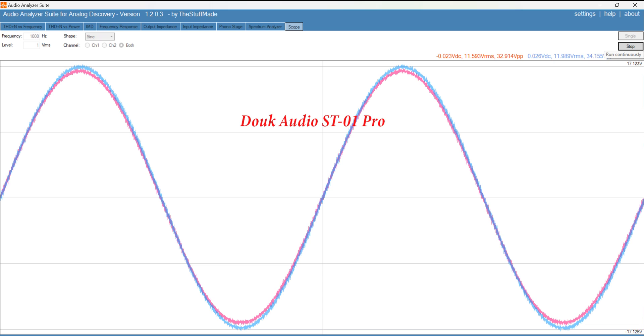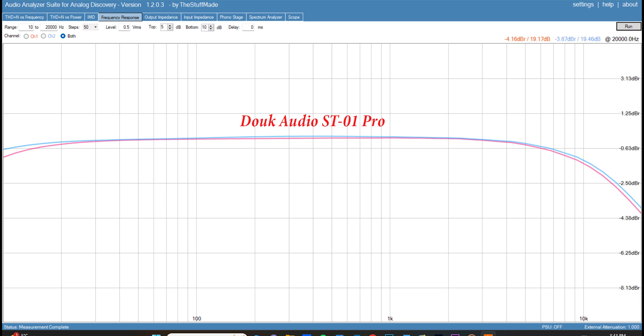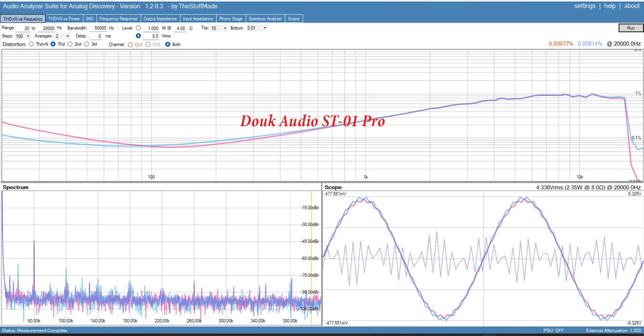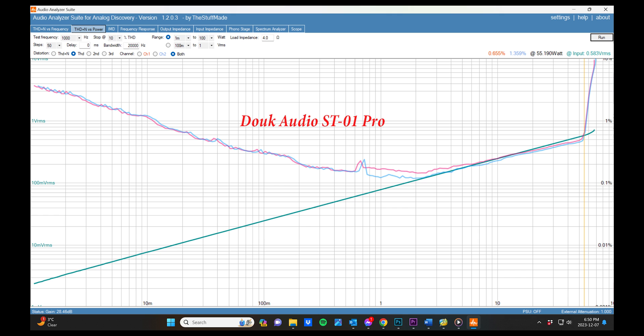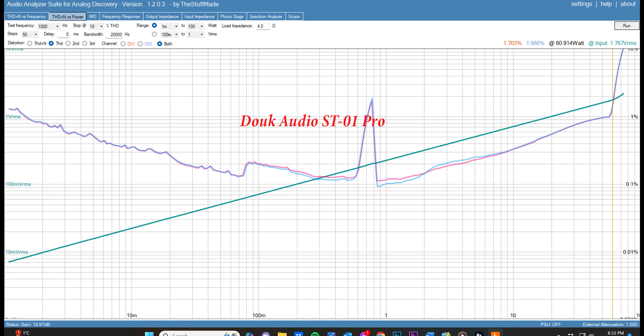On the scope, the sine wave was really nice on both channels and the square wave was fairly decent as well — not perfect, but for a digital amp it's pretty good. The frequency response was fairly good; there was a small dip in the high frequencies from 10kHz and above but it was just 2dB, so not too bad. The distortion managed to stay under 1% for most of the range, and for power I managed to get about 60 watts on a 24-volt supply and about 80 watts on the 30-volt supply, both under 4-ohm loads.